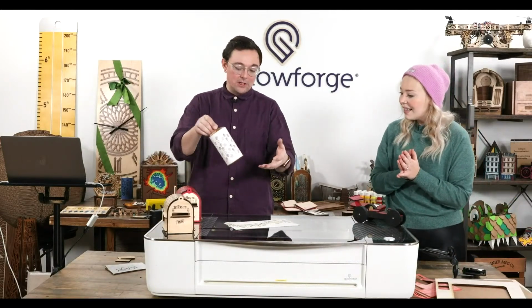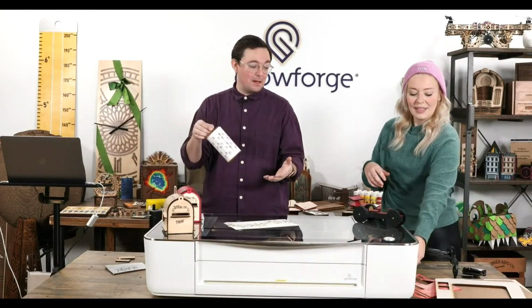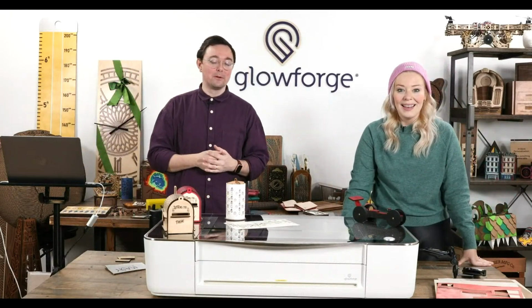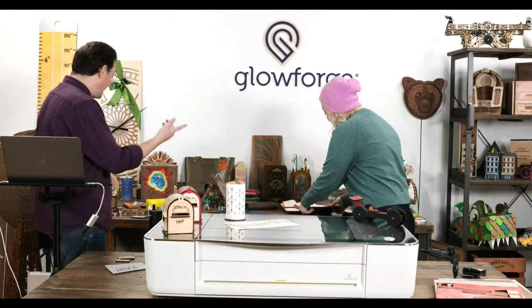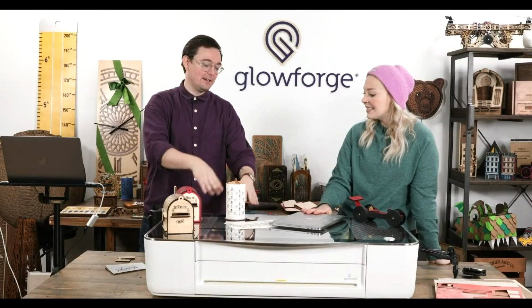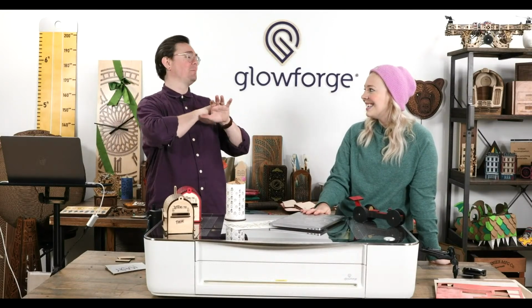And not just paper goods or wood either. I mean plastics, stamp rubber, as you may have seen in one of our previous live streams. Food, super popular. You probably saw on Instagram a number of pumpkin pies and things around the holidays. A MacBook, absolutely. Metal, painted metal surfaces, fantastic. Now, Glowforge can't cut through metal, I will say that. Same with stone and ceramic and things, this is a 40-watt laser. It would require a lot more power and a giant garage and a lot of safety stuff, but you can engrave these materials for beautiful results.